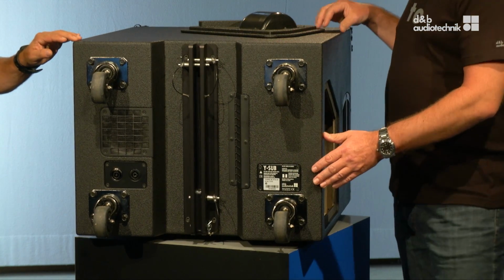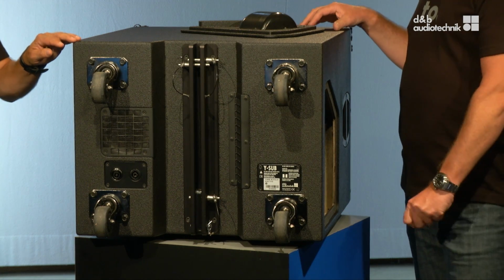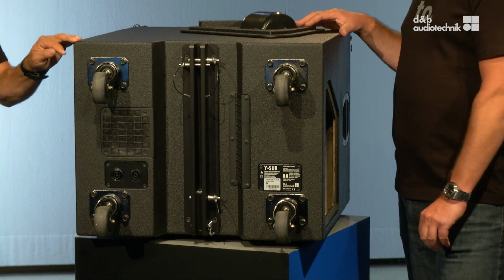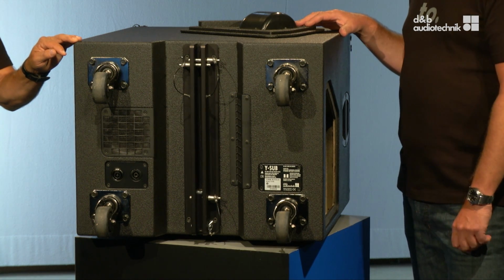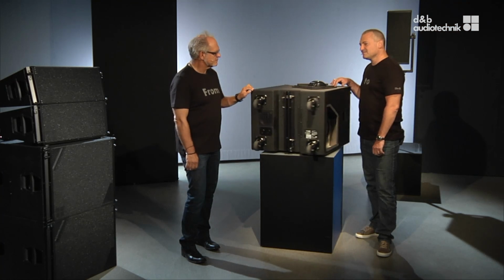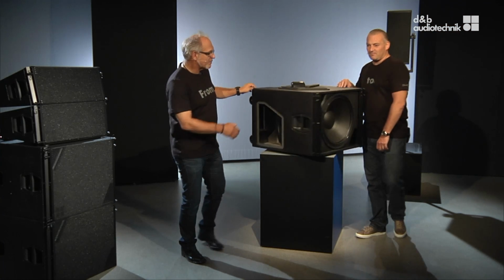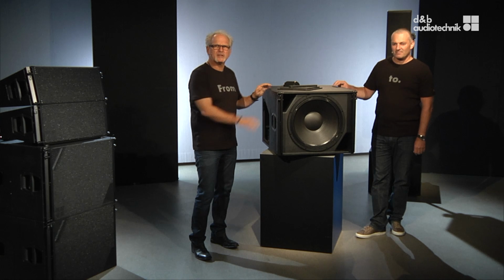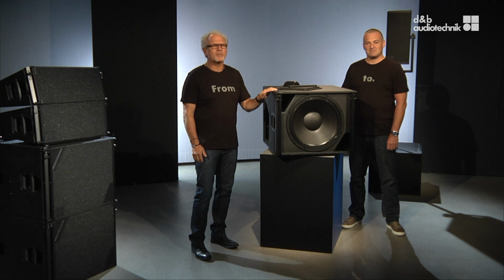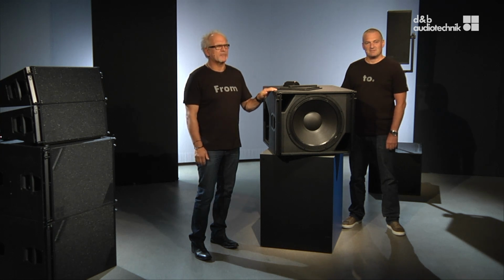The necessary magnitude and phase response is achieved entirely by a clever combination of loudspeaker and bandpass parameters. This results in a rear rejection of more than 12 dB, and all that from a single amplifier channel. It's basically the little brother of the V subwoofer, pretty much compatible in performance at a lower SPL maximum.